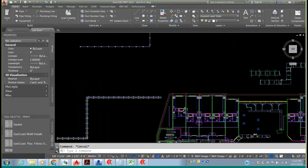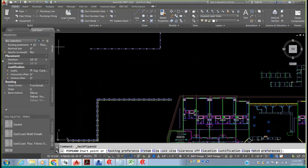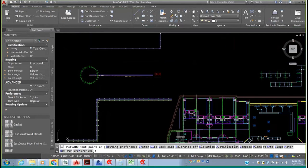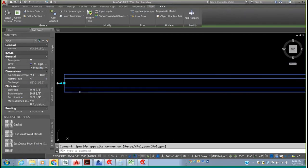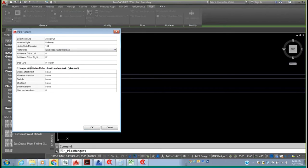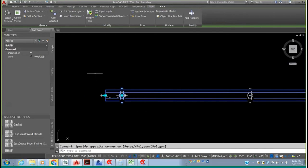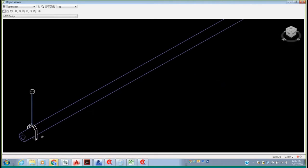To show different hanger styles, I'll run a 4-inch pipe with 2-inch insulation. After running that pipe in, you can see the insulation was added. When I click on this insulated pipe to add hangers and select steel pipe roller hangers, it picked up an 8-inch hanger because it oversized for the insulation. I'll go ahead and put these hangers on, and in the object viewer we can see the roller hanger alongside the clevis hanger.